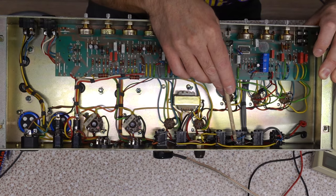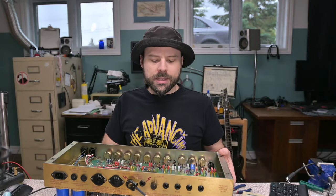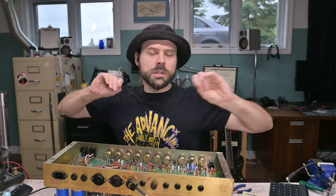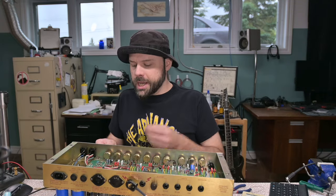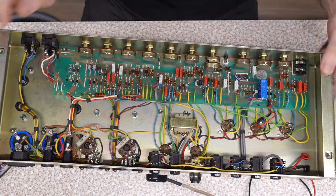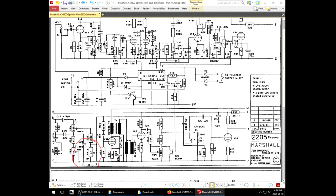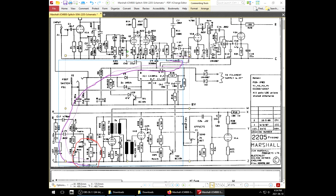The saving grace is that it isn't a solid copper wire — it's stranded, and because of how thick it is and how many strands it has, it's actually a fairly good ground connection. However, by design we should not use the shielding of a cable as the voltage ground bus source — that should be a separate wire. This brings me to the master volume: when you're playing with this amp and turn down the master volume all the way, you still hear sound. That's because of how they implemented the master volume. Signal from the clean channel comes in from one point, lead channel from another, and they're pretty much bussed together. But normally signal comes into the top of the pot and goes out the wiper — they have it connected differently.